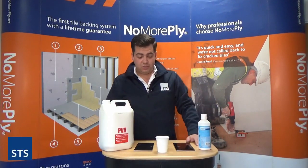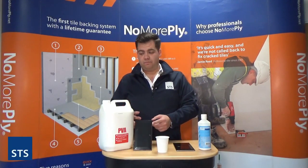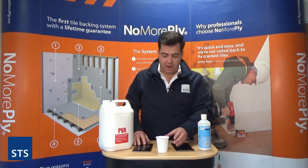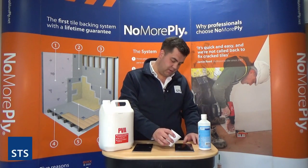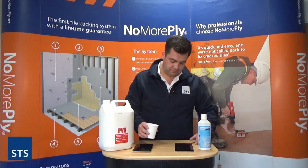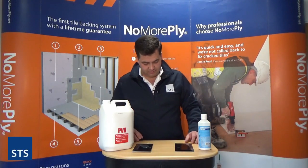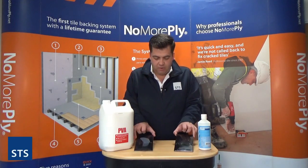What I've done is I've got two tiles — I primed one with PVA and one with SBR — and now I'm going to show you what happens when these two products get wet. So I'll pour a bit of water on that one, and a bit of water on the PVA, and just let that settle for a bit.